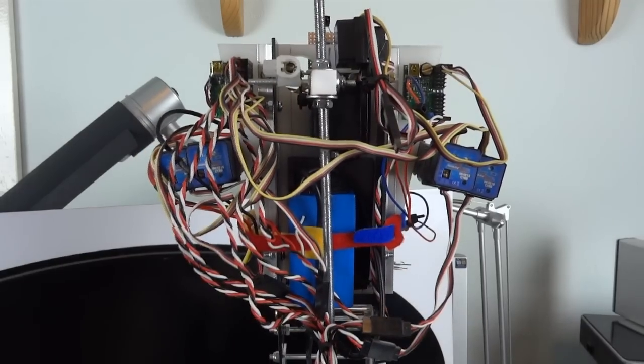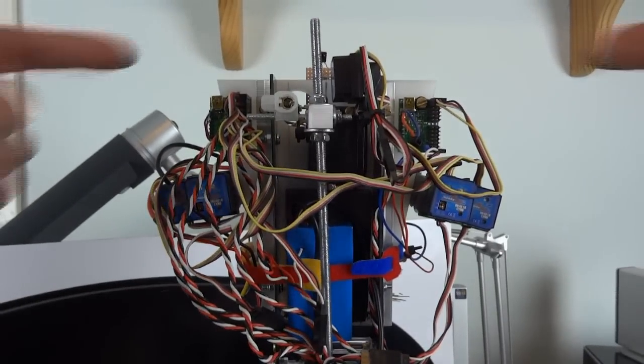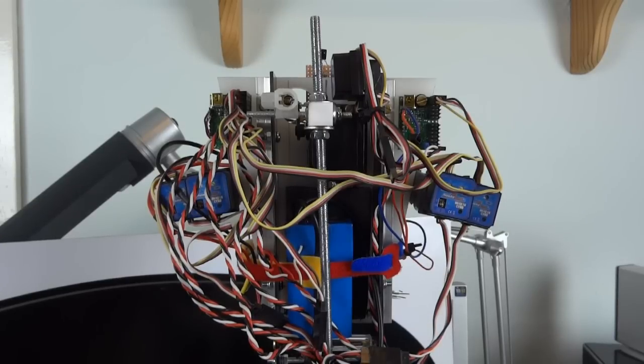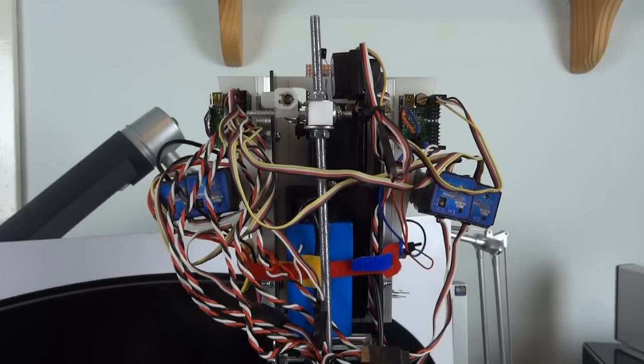I have two servo controllers, which are the two Pololu Mini Maestros, and as I said, if you look on my website, there is code for programming. There's basically PICAXE code for programming those, so that you can control all the servos. So as I said, they're on fixed timers and fixed positions, but the robot is actually dynamically stable.